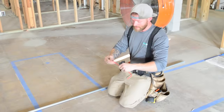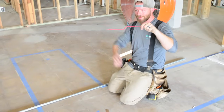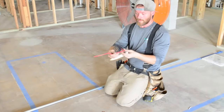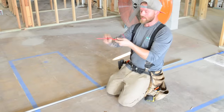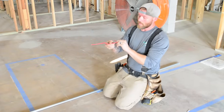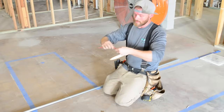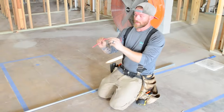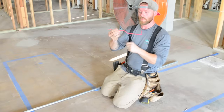For just one offset in a pipe, you can just flip the pipe over and still use that piece of pipe. The problem is when you have another bend, it has to be exactly right. You have to do it right. So the one thing that I always tell people is if you're trying to offset up, you know that your first bend, you need to bend down. Let's straighten this thing out. Your first bend is going to go down. Your second bend is going to go up. So that's what your bend is going to look like.